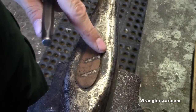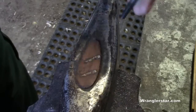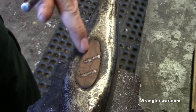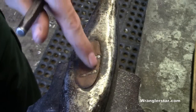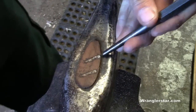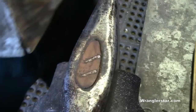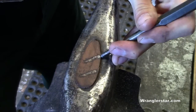The biggest problem with these handles is if they've got step wedges in them. This one here's a double step wedge, and these are not always straightforward to get out. We're going to try the easy way first and get more medieval on it if it won't come out. We want to be as careful as possible not to damage the outside wood. The first thing I do — and I have moderate success with this — is using a center punch with a pretty pointy edge ground on it. I'll come under here and strike this to try to work it out.